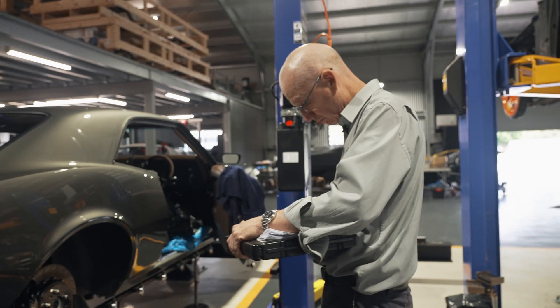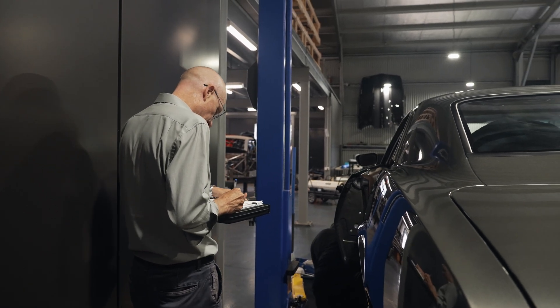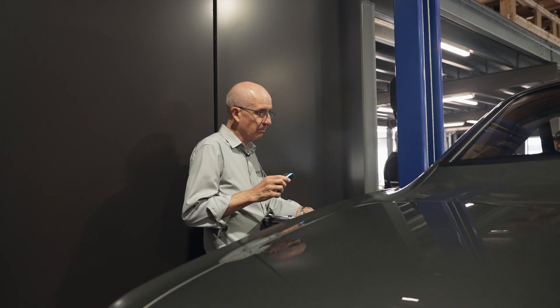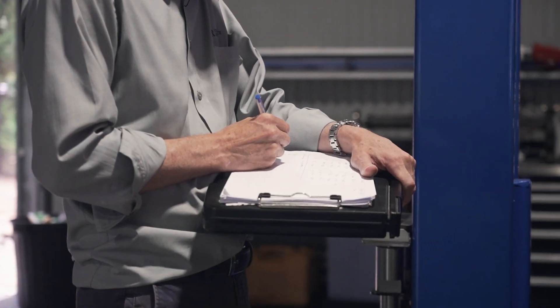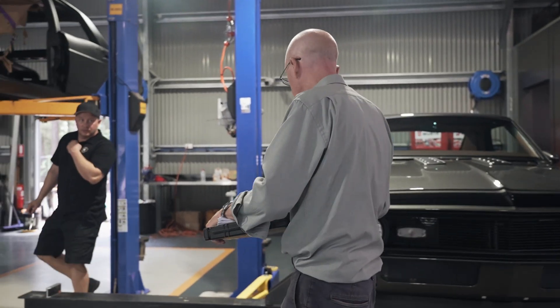Reading the dial gauges: 72, 98. So that's very little deflection but it's the right shape — we're a little bit at the edge, down a bit more in the centre and then back out. 0.4, and that one's on 0.2. We're two metres off there, we're going to check that. That result is outstanding. I've obviously got to do some calculations to show it in greater detail, but all the numbers make a lot of sense — very little deflection, very little twist. It's a very rigid package.